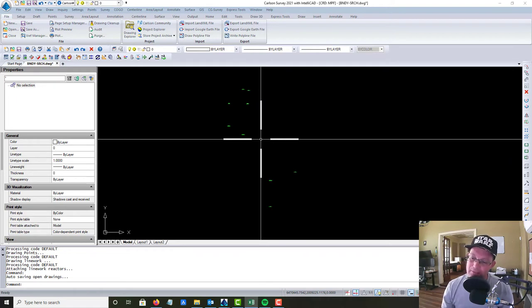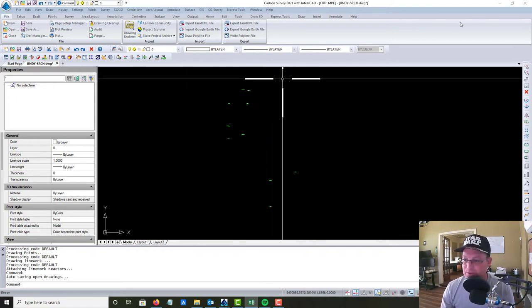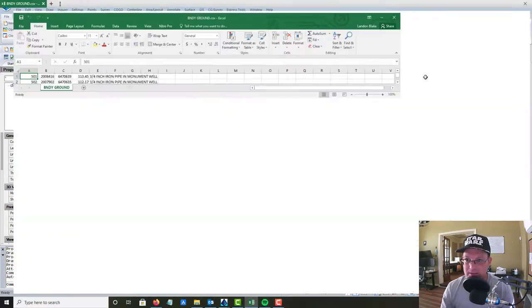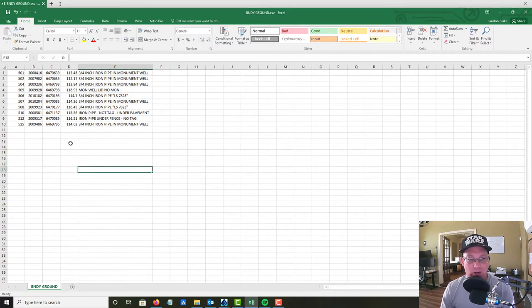Okay, so I've got my search drawing open in Carlson, and I went ahead and imported my points. The other thing I wanted to show you guys is it's really important when you start this process that you have a good point file. So this is my point file, and what I did is I went in and made sure that I had descriptions on all these so that I knew what I was dealing with.